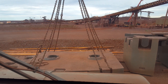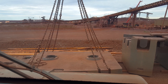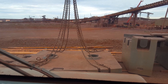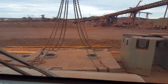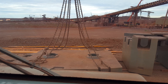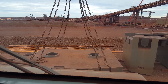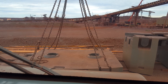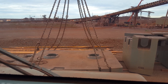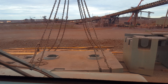Now it's hard on the slew cranes because you're so far away from the load to know if it's center. But if you're on a crane which is close to the load like this, there are a couple of little tricks. If you're over center and you're not confident in your crane driver, one of the things that will happen is when you pick up the chains and you're over-jibbed or under-jibbed, two chains will go straight first. The front two chains closest to the crane will start biting first — that's a clear sign you're over-jibbed. If the back two are tight and the front two are loose, you're under-jibbed. So if your chains aren't all pulling up the same length and they're not balanced, you know that your jib's not right.